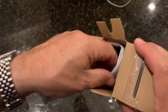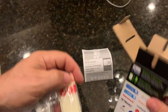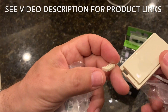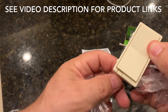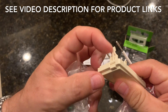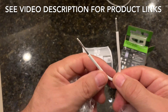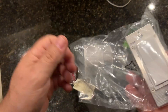When you get one of these, you'll get an instruction book that explains the wiring, and I'll show you in this video. You'll also get an almond-colored paddle you may want to swap out to match your house. This is called an air-gap switch — a little plastic piece goes in the bottom that functions as a pull-out switch. Pulling it out resets the switch and removes all power; pushing it back in restores power. They also give you a white neutral wire to connect from your house wiring into the back of the switch.